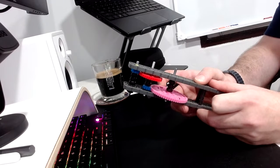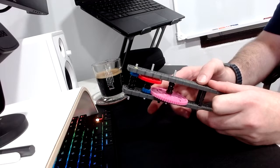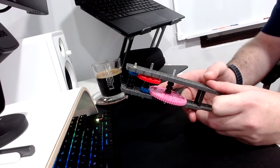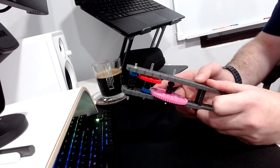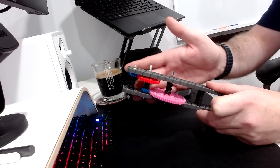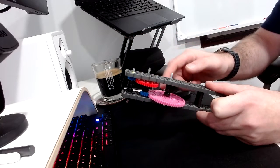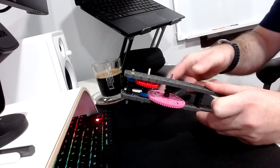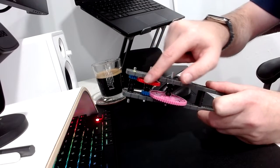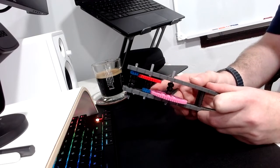If you have a look at the difference in speed between the smaller 12-tooth gear here and the one on axle number three, you'll be able to see it spins much, much quicker. So if we consider our gear ratios: a 60-tooth gear driving a 12-tooth gear gives a gear ratio of 5 to 1. We also have the red gear here, which is being driven by this large pink 60-tooth gear because it's on the same shaft as the smaller 12-tooth gear. And then the 36-tooth gear is driving the top 12-tooth gear, allowing us to create a very, very powerful mechanism.